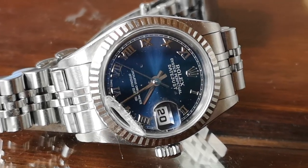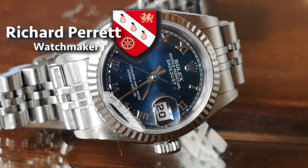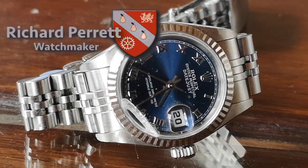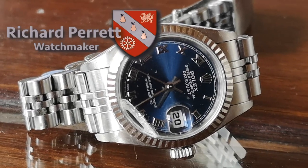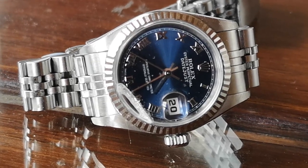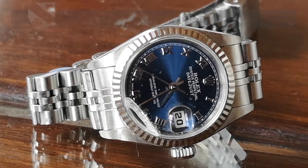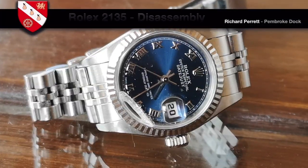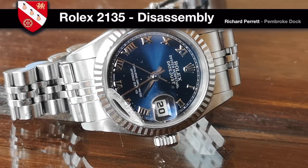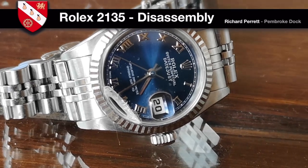Okay, and here is the Rolex that we're going to be repairing and servicing in this video. And as you can see, it's had a little accident. The glass crystal there has been shattered at about the 5 o'clock position. Quite why I'm pointing that out, I don't know, because it's pretty obvious. I have also put it on the timegrapher, and it is losing about 20 seconds a day in pretty much all of the positions.